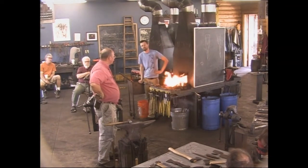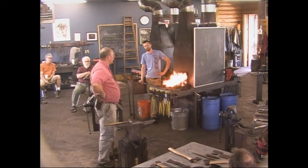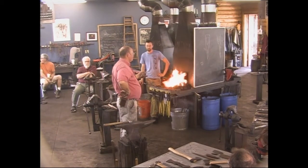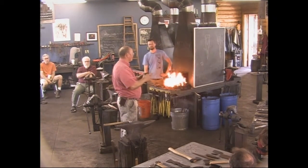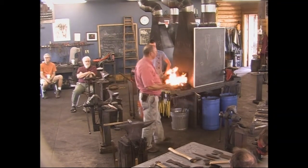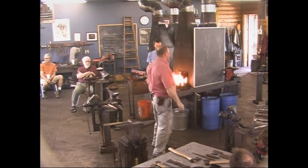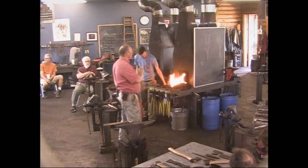If I'm doing things that require smaller forge welds, I really prefer the coal forge because you get much better control on the heat. For axes, I like the gas forge because I can bring a nearly finished axe back up to welding heat very easily and get the whole thing at an even heat. And I can work on two axes at once and not worry about burning them up. Right now I would be forging the alternate axe and being a little bit more efficient, but in the coal forge I always burn up the other piece.